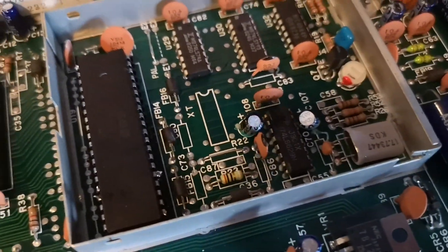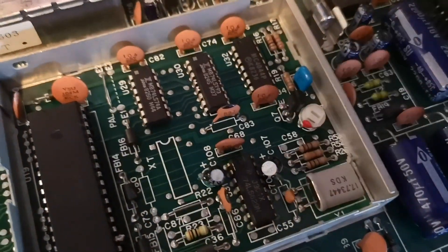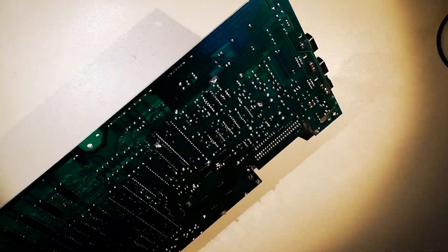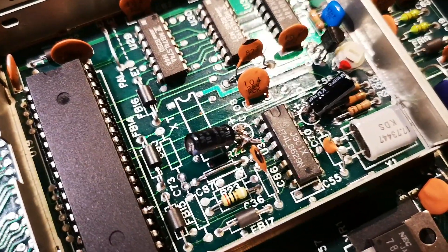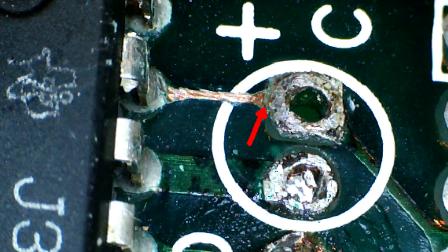It leaked really badly, but that is a common fault on this KU and other boards. So I can't check if the clock is running, but if there's no signal then there's usually no clock either, or there's something wrong with the path into the can here — the modulator.